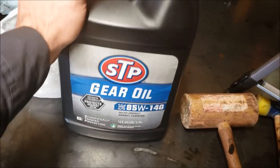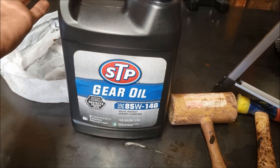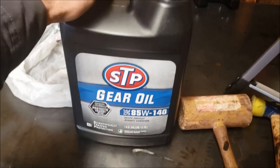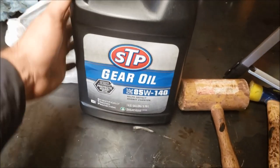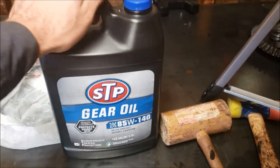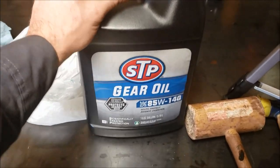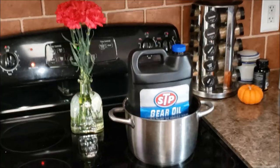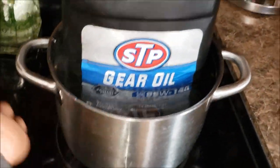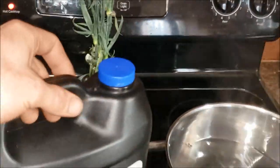One last thought here: gear oil. Most manufacturers are going to recommend an 80-90 or an SAE 90, but I say run 85-140. These aren't high-speed differentials in these tractors and they're not spinning that fast. So if you get a thicker viscous fluid like this, you're going to be less susceptible to having leaks. When I use a really viscous fluid like this 85-140, I like to simmer it in a pot of water for 15-20 minutes to get the fluid nice and hot so it will just pour in there nicely.